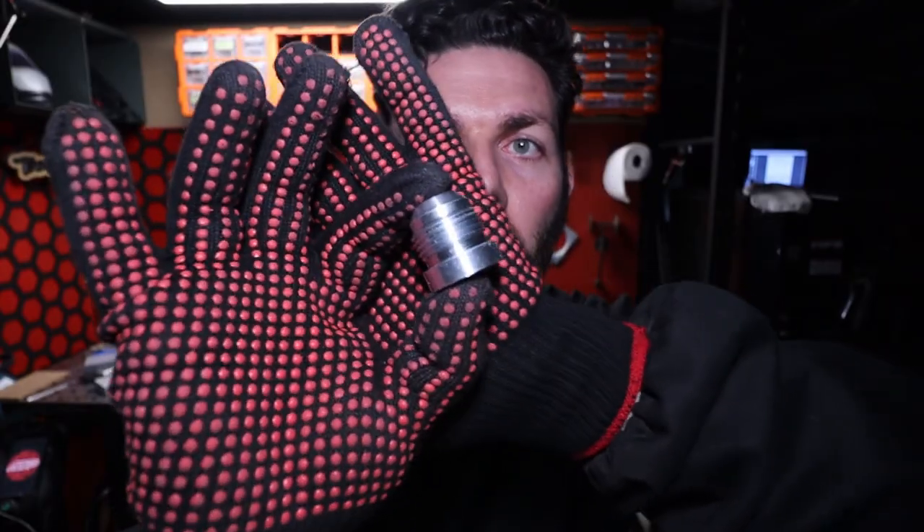For me, it works pretty great welding fittings onto the front of my cans, which is what the feature is designed for — thick to thin. I've also had great success welding 10mm thick aluminium with the MixTIG feature. That was the experiment: see if it's possible, see if it's better. But really, it's just me doing it so you don't have to.